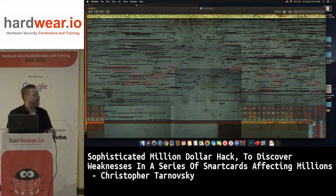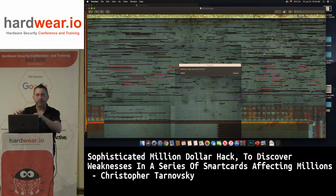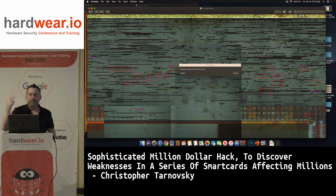Atmel's crypto, every value of the flash falls through an avalanche of this cryptographic function. And it's a bunch of nonsense. It's nothing you care about. And it's kind of funny because you just go to the input of the gate, you go to the output of the gate, and you keep going until you hit the flip-flops.